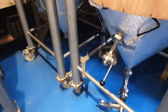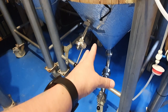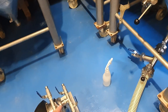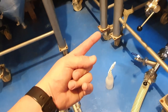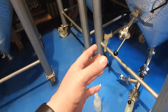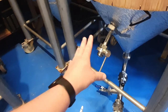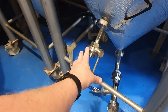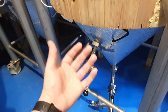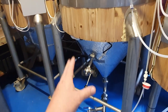The routine is: we put caustic in the tank, the caustic flows out of that side pipe, into the pump, out of the pump, back into the tank via the spray ball. Bearing in mind, if your tanks are sealed, you need to have some ventilation there — so I don't connect this pipe up straight away. Because if the tank gets warm it will either explode or implode depending on what you're doing. Something to bear in mind as well: if you've got CO2 in your tank after fermentation and you use a caustic, the sodium hydroxide will scavenge the carbon dioxide and create a vacuum inside the tank. I've seen tanks implode because of that. So you need to make sure that your tank is always vented to atmosphere.